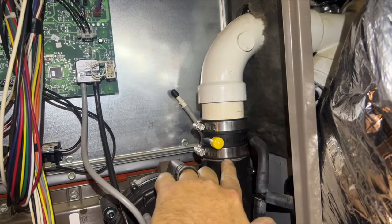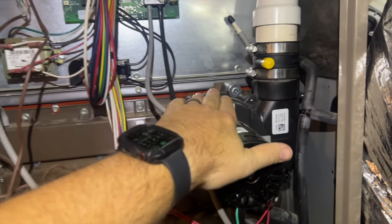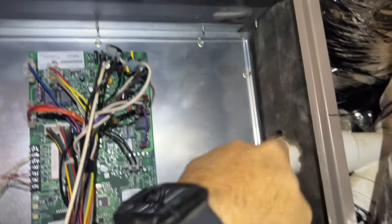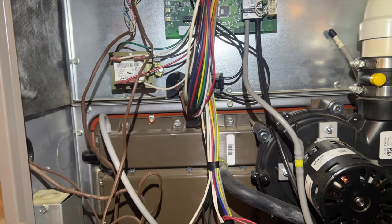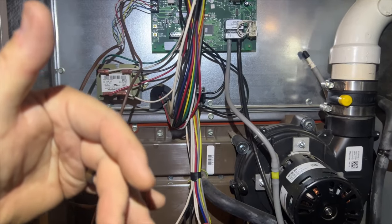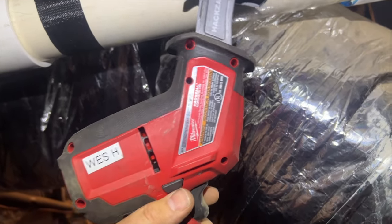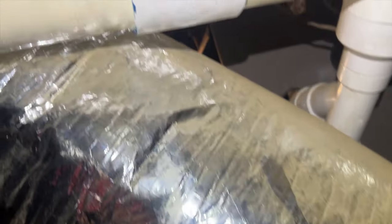In order to remove this blower we've got to get rid of this first. We can probably wiggle it where we don't have to take off the inducer, but sometimes you do. There are screws all around the edges and there's actually a door switch right there. I've killed the power at the breaker, which you should do. Once we get this out of the way I'll pull the blower out. I've got my Milwaukee hacksaw and we're going to chop it here so I can get it off.